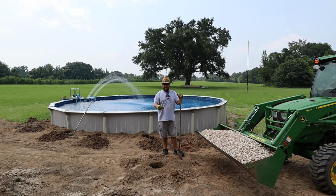I'm a big believer if you're going to put your post in a hole and put concrete around it, you have to allow the post to free drain out the bottom. Think of a post, it's full of natural wood fibers which look like straws under microscopes. I used to deal with this back in my previous job. Those fibers will actually pull in and release moisture. If you seal the bottom of the post in concrete or in a thick clay soil substance to where the post cannot free drain, you're going to have a rotted out post quickly.